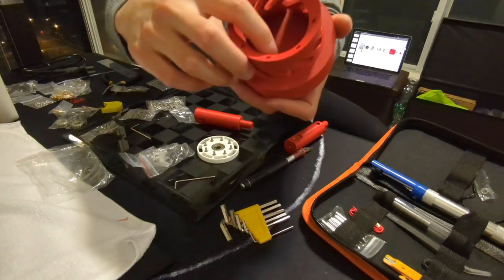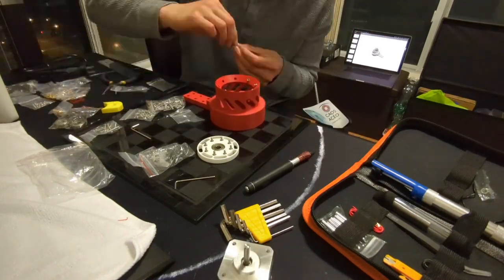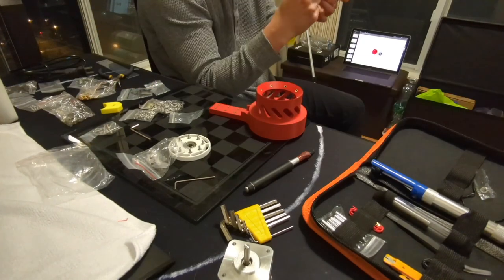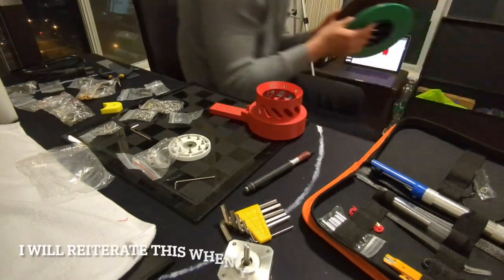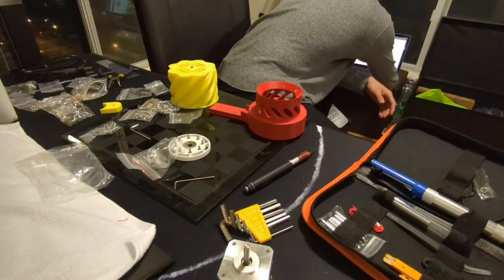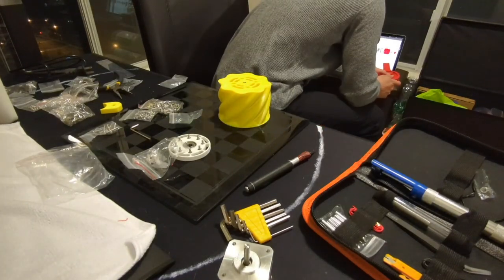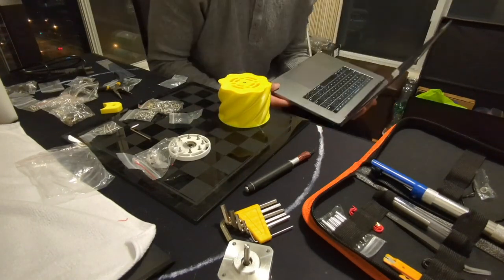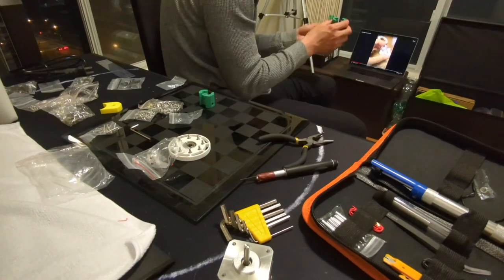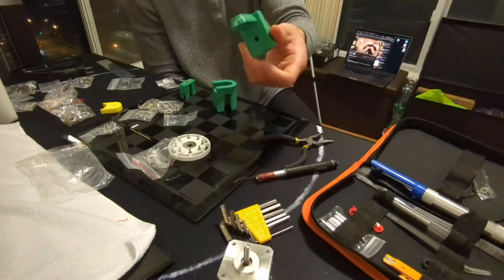This piece makes me nervous because it looks so fragile. In the gearbox, there's a very fragile piece meant to hold onto the thermistor according to the video — but that is an old version. Do not attach the thermistor to that piece; it is not going to help. After the gearbox, we found out the spool holder was now printed as two pieces instead of the previous three — the pieces are just fused together for better printing. With that, we are done with all the heat inserts and individual parts.